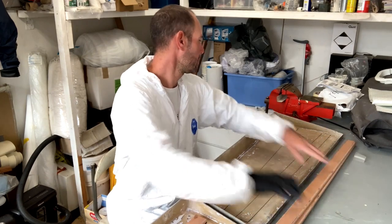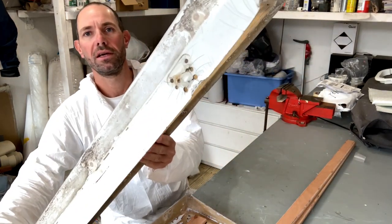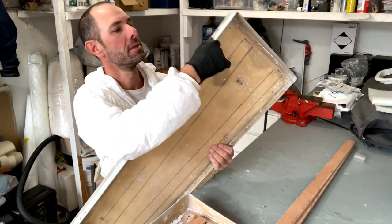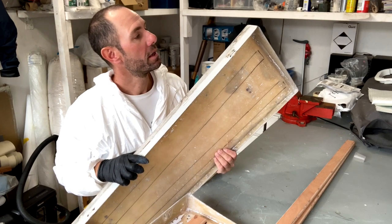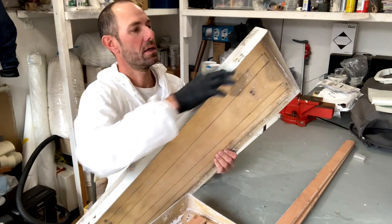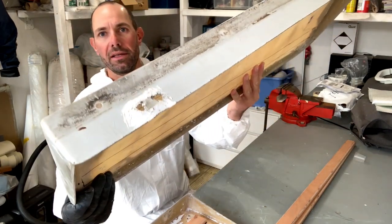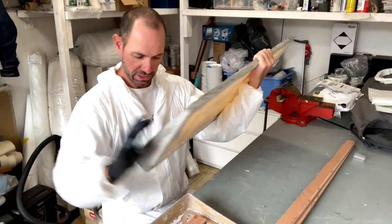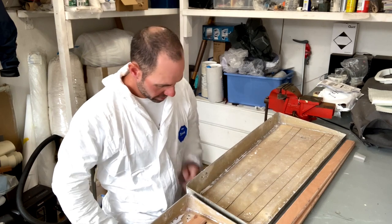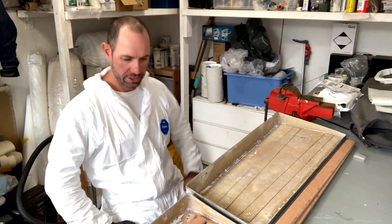This one in particular has got pretty mashed. If you look in there, there have been multiple catches over the years — they've obviously pulled out and broken and that area is a little bit weak. So I'm going to have to grind out some of these cracks. Same deal there — that's had a repair and you can see on the inside where it's all damaged. That'll get ground out, I'll lay up some glass in there, and then it can get re-gel coated and it'll be ready to go back on the boat.